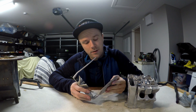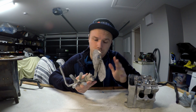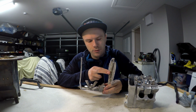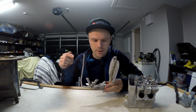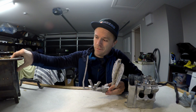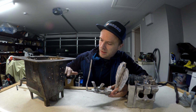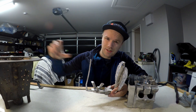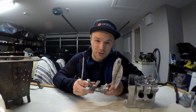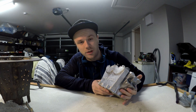I managed to find the reason for the vacuum blowout. The sprue was quite close to the edge of the flask — only a few mil off — which I didn't think would be a problem, but the vacuum goes in the hole and then along the side of the steel to where the sprue was and sucks the aluminium out. So I'm going to have to definitely modify my flask quite a bit to make a proper vacuum flask — it's going to need much more holes, and I'll have to make it wider so it's got at least 12mm clearance all the way around every single piece of the 3D print inside. Overall it looks partially like a cylinder head.